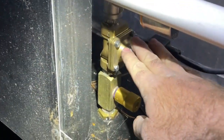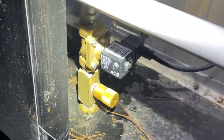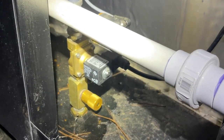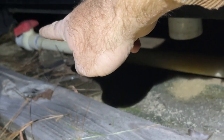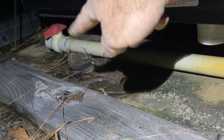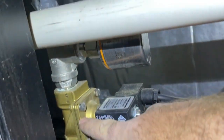So the water also has to shut off. When the pump turns on, the water turns on. Well, most of us go to shut our kilns down and winterize them. We walk out, shut the pump off. In my case, my main supply line tees off and goes up to the kiln, but then I run over and I've got a bypass and a drain. So I shut the water off up at the house, then open that bypass and just let it drain out.